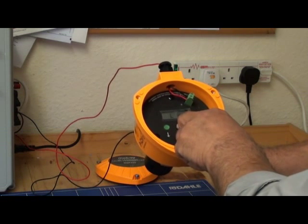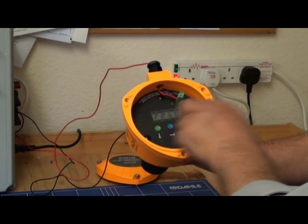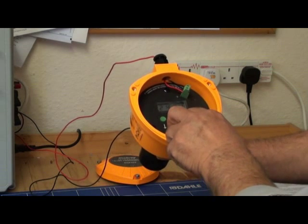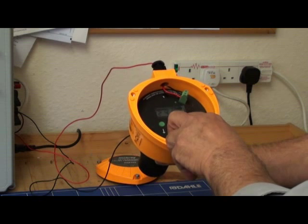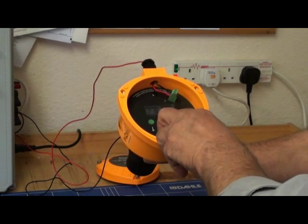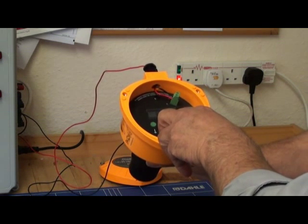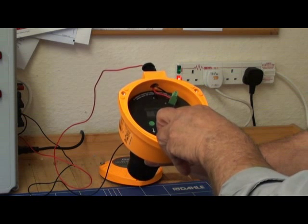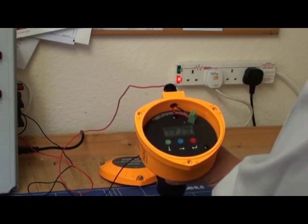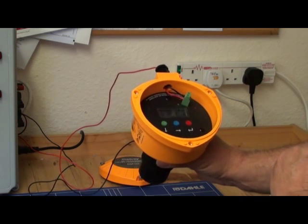The display will then change from metres to feet. The display that previously was nearly 7 metres is now 22 feet. Holding down the blue button again will then go to inches — from 264 to 288 inches. Hold it down again and we will come back to metres: 7.3 metres. Once you have reached the required display units, just release the blue button.